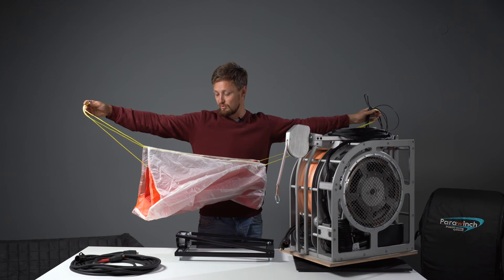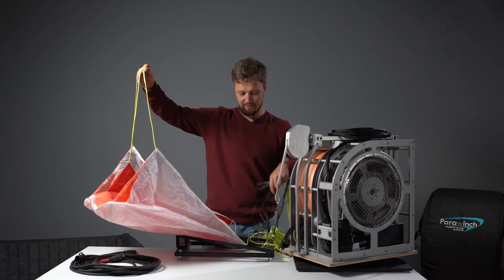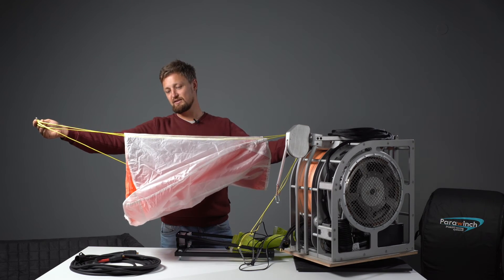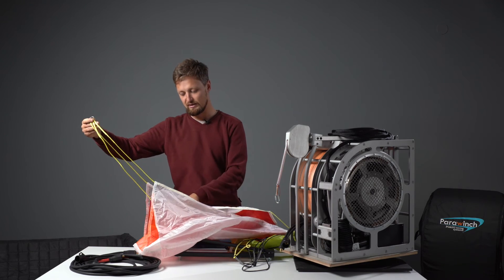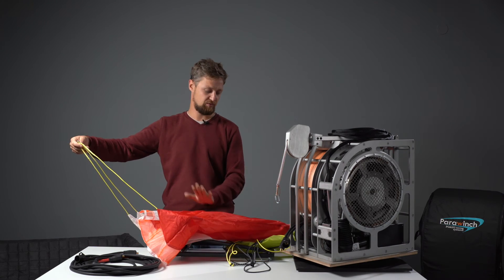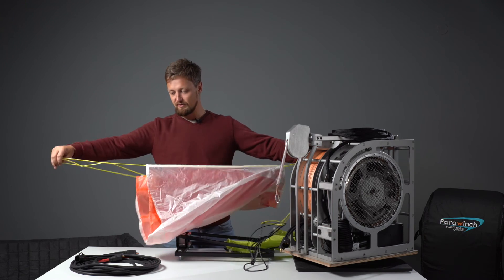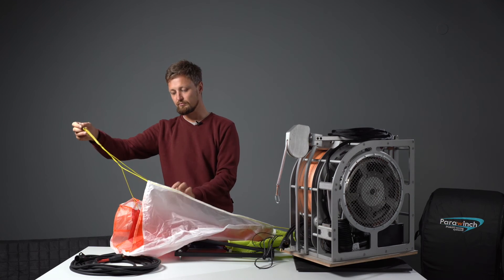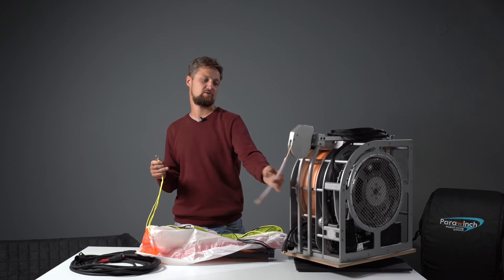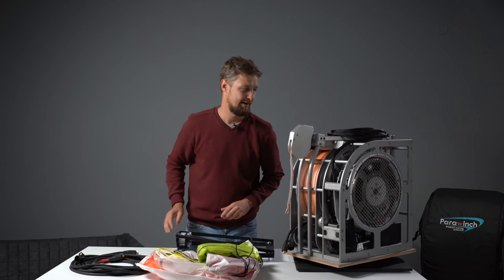The kite has five lines and takes on its flying shape when you're being towed, providing just a bit of drag. A very important thing before every tow is to have the kite properly folded. Sometimes after retrieving the line, the kite can be inside-out — in that case, ventilation can be delayed. That's why we use two colors: white on the outside and red on the inside. The correct fold has the center line folded inside with the red color hidden. If you see red, something is wrong. The kite also has a carabiner that connects to the winch line.